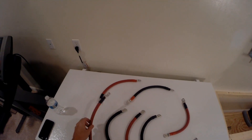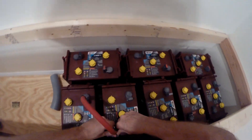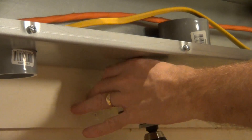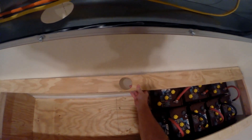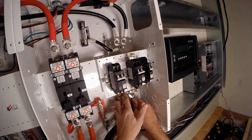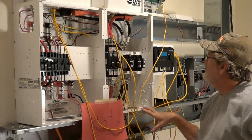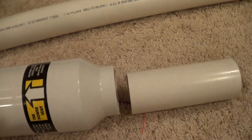Got all the 4-aught cables with the 4-aught lugs. I'm going to put these two in series. They say to torque these battery terminals to 100. I got this piece cut — four cables. They'll get cut a little bit more when I get them in. I need to get my torque wrench on here: 4-aught positive, two 4-aught negatives. Up through the conduit — I've got 50 volts to the panel. Not quite done yet, but starting to come together.